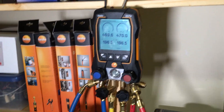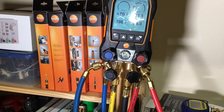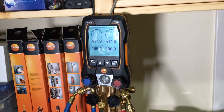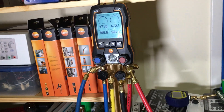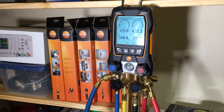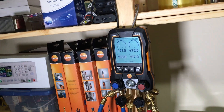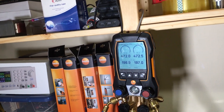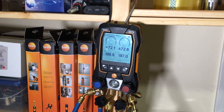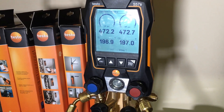If I find something with the ultrasonic leak detector on this hose, I will be making another video. If I cannot find anything with the ultrasonic detector, I'll probably put a little squirt of vapor R-22 in the system, pressurize it further with nitrogen at a higher pressure, and come over it with my leak detector to try to determine why this failed. That's it guys — I'll see you on the next video. Unfortunately I'll be deleting that really bad video I took using my work phone instead of my dedicated video phone.